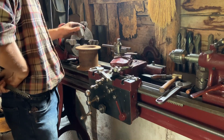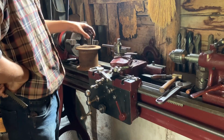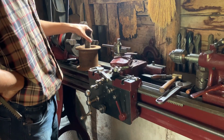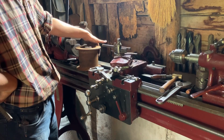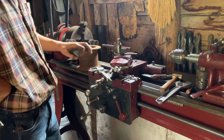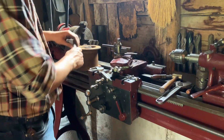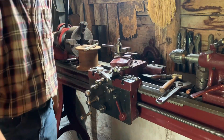And yeah, that'll be that. I'll also need to drill a set screw in this because there's no trace of one, which is kind of funny. So we'll line it up with the keyway and drill a set screw, just a standard head that can go in where the pulley is instead of having an exposed square head, just a flat screwdriver type affair. And that'll be good. Then we'll throw it on a planer.